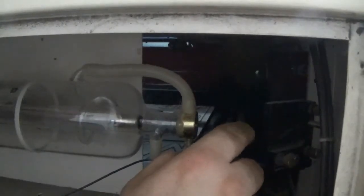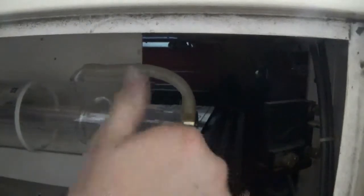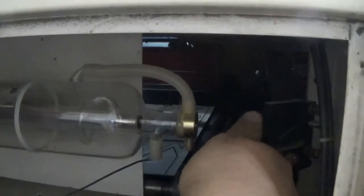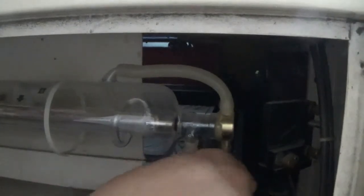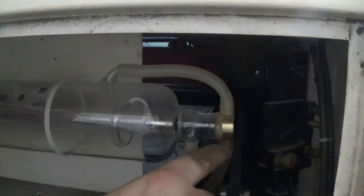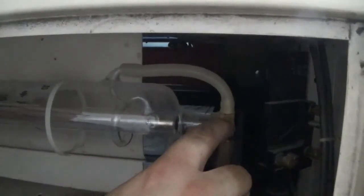Your laser tubes should be the same diameter. If they're the same diameter, very little to no adjustment will need to be made on your mirrors — they should be in alignment. If they're not in alignment, check my video up top and I'll show you how to put them back into alignment. You want to take your big thumb and slide the tube all the way up so it's about a thumb away from the bracket and the mirror. Then go ahead and hook up the water line — this is the water discharge. You want this tube to be oriented straight up and down; it's the hottest point of the laser, and it'll do a really good job keeping that cool.